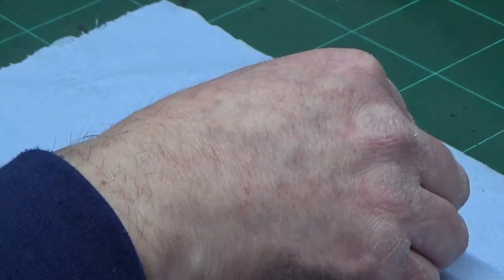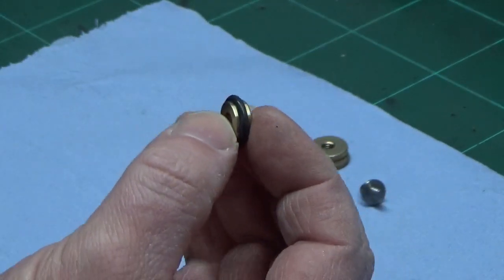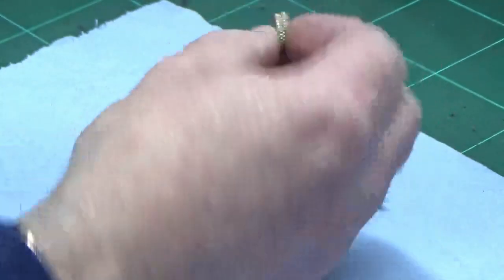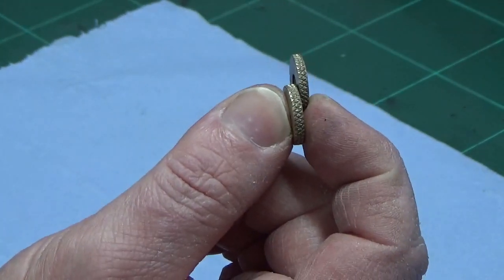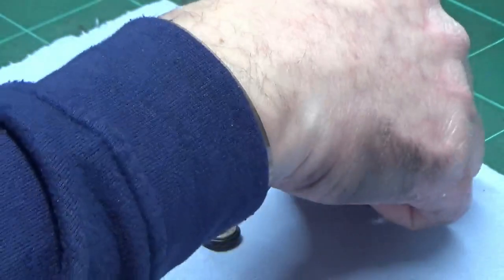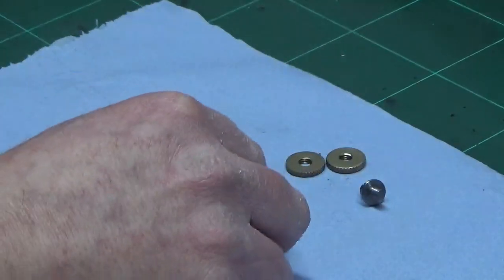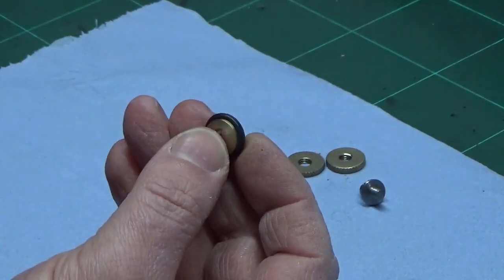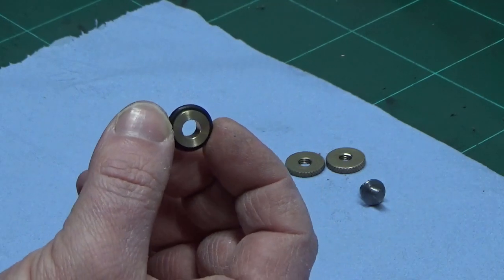And I've made the cam follower, which was a bit that I'd still to make, and I've not filmed any of these bits, guys, because you know it's basic stuff. OD, a tapped hole through the middle and a knurl on the outside. So just, in terms of keeping these videos at a reasonable length, there's bits here that I've not filmed. Same with the cam follower, really nothing special about that, other than I've strayed away from the plans again.